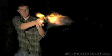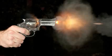So there's a handful of you out there thinking, well, why don't you just take the output from the piezo and run it through a MOSFET or something like that, and you can vary the threshold on that MOSFET and then send a trigger to your flash. Why don't you do that, Destin? Answer, because I like taking pictures of the bullet itself. That's why. This thing has a really, really fine temporal resolution. It's like 25 picoseconds.